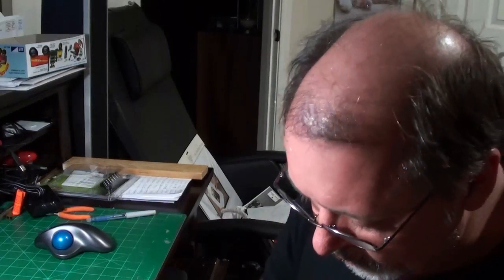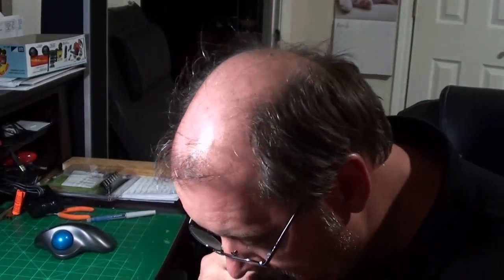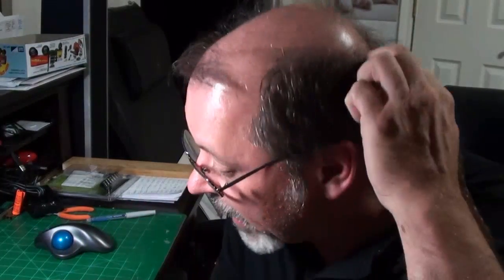Here's a third one I got at Goodwill. This is definitely a phone charger, you can tell. Alright? It's 5 volts, 550 milliamps. Okay? So this is 25 LEDs too at 5 volts. And that'll power a 4060 timer. But even better, it's got a USB output on it. So, you know, I could just charge my phone with this if I felt like it. So you just got to make sure your phone takes the 5 volts. Easy, there's the trick. But if you got a USB port on your phone, this will work. So I just wanted to go over that real quick.